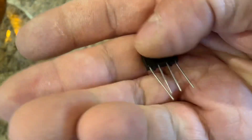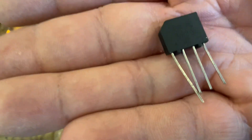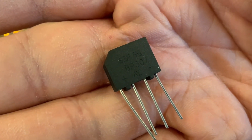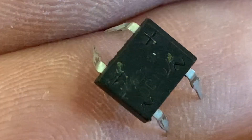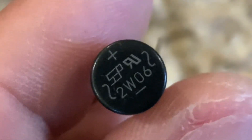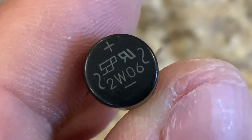In order to work this magic, we're going to rely on this little miracle component known as a bridge rectifier. It takes in some sort of electrical signal — AC is marked here — and converts it to DC, which is really handy for us. They come in all shapes and sizes, including this really small one, and they're always marked with squiggly lines for AC and then plus and minus for DC.